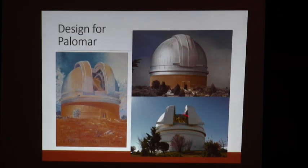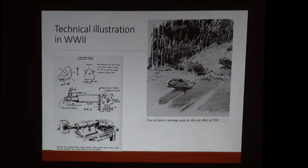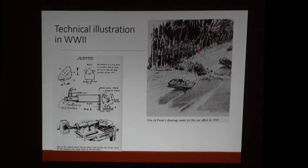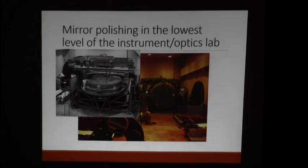He also designed the building for the 200-inch. This is his original watercolor of what it should look like — he got the greenness of the vegetation on Mount Palomar correct. It was going to be aluminum paint, and originally it was, but then they found that was wrong and now the whole building is white. He also designed a scaled-up version of the mirror grinding machine. Making the machine out of steel was an innovation — before that, grinding machines had been wood because nobody had made anything larger. Apparently even the 100-inch was ground on a wooden machine, about 20 years earlier. This is a Caltech photo of the mirror where, not only do they have people for scale, they've also put Herschel's telescope and Newton's telescope inside the blank for scale — showing how big it had gotten.